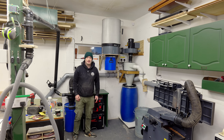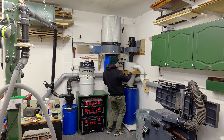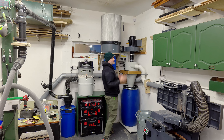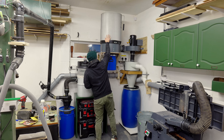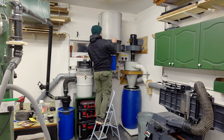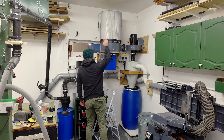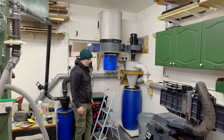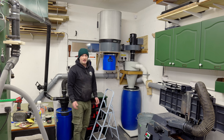So just to explain how this two-stage system is meant to work: chips from the planer and sawdust from the saw come in via the ducting into the cyclone, and the vast majority will spin at high velocity down the cyclone and into the large drum. The suction comes from the impeller in the motor up here, and some of the smaller fine particles of dust will make their way into this part, with air exhausted from the motor through the cartridge filter. After a while this filter will get some small particles of dust in it which I can clean using the handle, and those fine dust particles should then fall down into the barrel. Essentially, adding the cyclone means the cartridge filter will clog up a lot less, meaning much less regular cleaning and better airflow for the system overall.